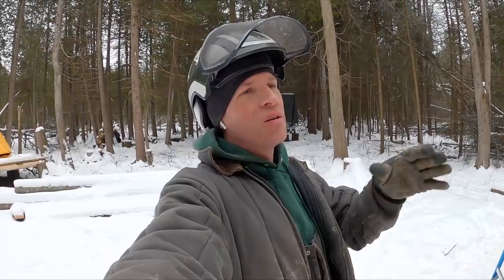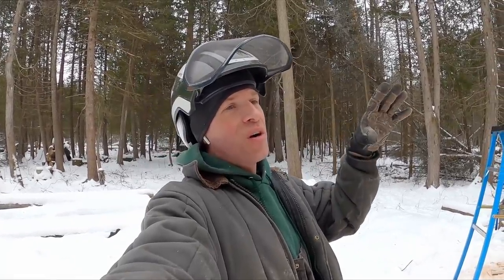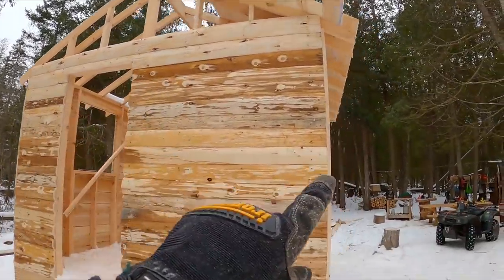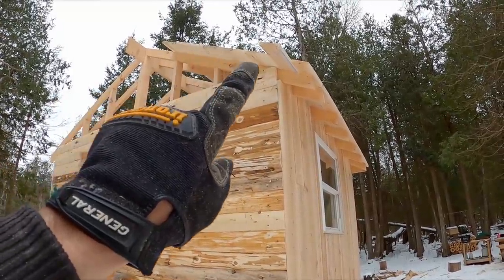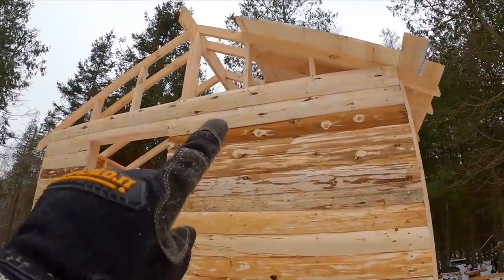There's a reason I'll start, say, one wall before another wall, or the roof before that, or whatever, and kind of go back and forth, like did the walls before the roof, because the walls, when you put the siding on, it firms up the whole building. I don't want to be on the roof and have the whole thing moving around. And then I do one wall and get so far, because I'm not sure if I have enough of a certain kind of lumber to finish it. Like this front wall, I couldn't keep going up because I didn't have any more of these. And then I got to another couple walls, had to mill up more logs, and all of a sudden I have more of these to go up. I started the roof to figure out how much I'd already milled of that aspen up there, see if I had enough to do the whole thing. Anyway, the point is, now I come back to this to finish it up.